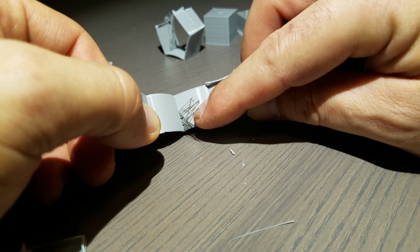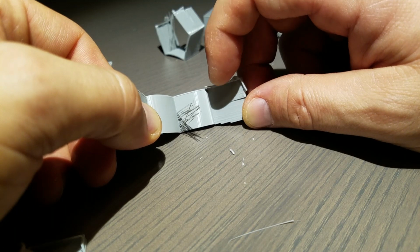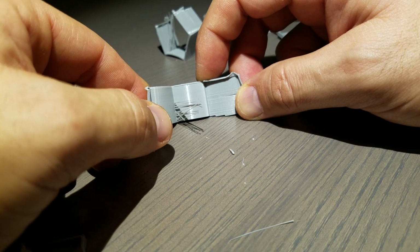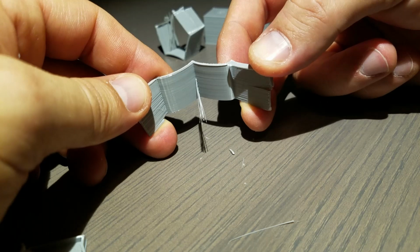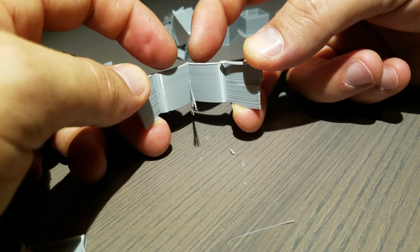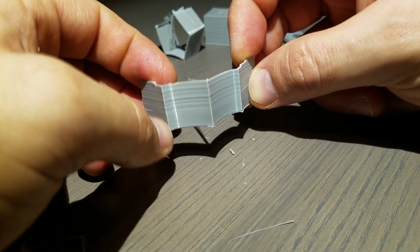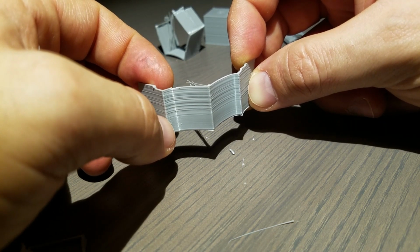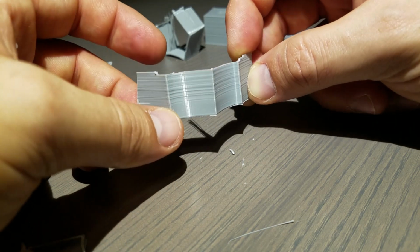It doesn't make sense why for 40% of the cube's height the nozzle travels concentrically and then all of a sudden starts skipping or jumping diagonally across to continue building the cube and finishing it. And as I position this into the light, you can see that the walls inside, at least these two walls, are very smooth. And on the outside, they're not as smooth. It seems that they're only as smooth on the outside as the nozzle travels concentrically. Once the nozzle travels diagonally rather than concentrically to build a cube, then the walls start to chatter.